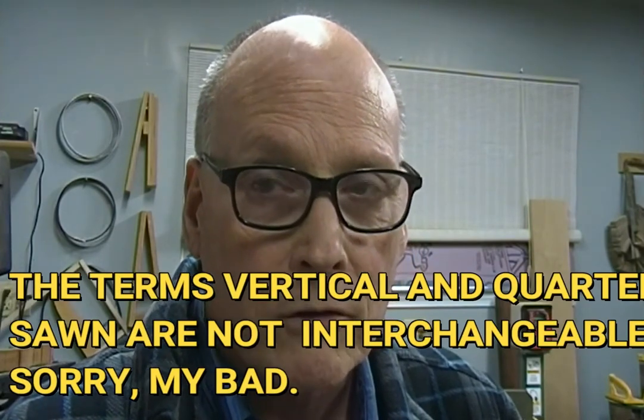I'm going to readjust the camera and show you what I'm talking about. This is a very shallow side, so you don't need a lot of available vertical grain to get quarter sawn out of your piece. If it were an acoustic side that was four inches or slightly under four, you would definitely need a bigger board. You would probably either not use quarter sawn or you would buy it already as side sets. That's part of why those side sets and back sets are so expensive — because of the quarter sawn wood aspect.